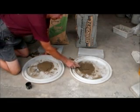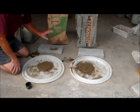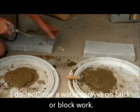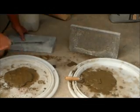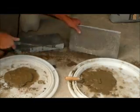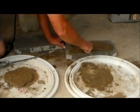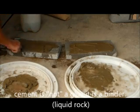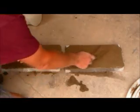Portland is what they use on highways, patios, anything like that. If I have to fix something, it's always going to be with Portland. Whether I'm using Portland or mortar, 90% of the time I use Portland. When I need to stucco something or stick something together, I always wet it first — I use a sprayer. It's an easy way to wet it without using a sponge. I wet it first, then I take my mix and put it right on top of the wetness — it gets right in there. If you don't do it when it's wet, it ain't going to stick. Same thing with the mortar.